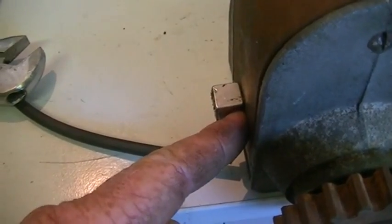I just put a couple of N52 square neo magnets on there. North to north, so we increased the north field, and south on the south side. It's definitely improved it — we've got a nice blue spark now, definitely some power there. They're going to stick — they're stuck on a bit of steel of course — and it made the whole shebang work quite a bit better than what it did. We'll leave them on there and bolt this back on now and see how we go.